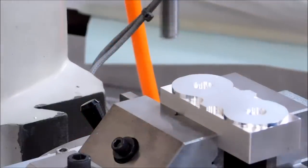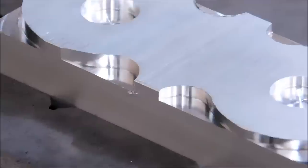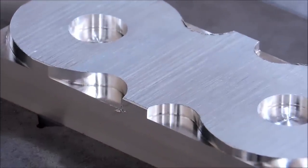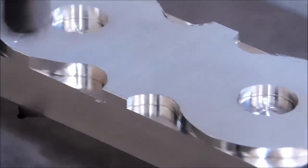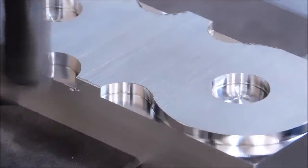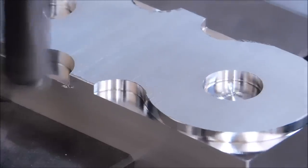So this is when you bring the cutter down. Let's refocus. See if we can find those pockets and knock them out. This is strictly XY moves with the mill table. The rotary table is locked.